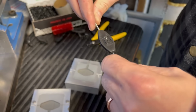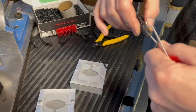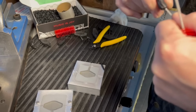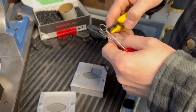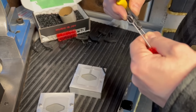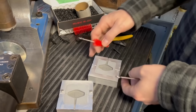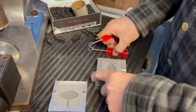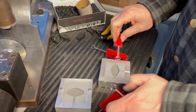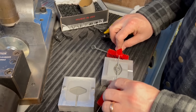And it's still very hot in the center, so to really produce anything with it, you'd have to hold these aside and let them really set up. Yeah, that's one advantage of pure aluminum. It'll pull the heat away faster. One of the things I was curious to find out is how much this is going to pull the heat away. But we'd have to do quite a few injection cycles to find out.